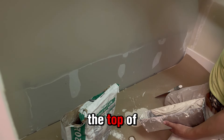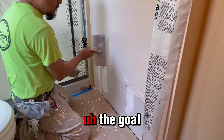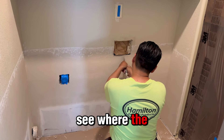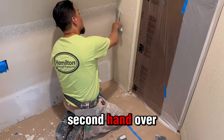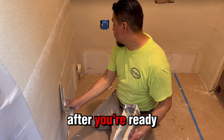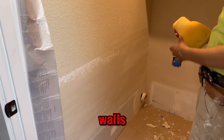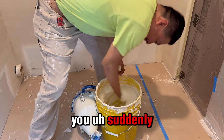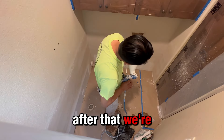We're covering the damaged parts and also doing a little bit more at the top so it can blend in and you don't realize what we did. The goal is just to create the texture so you don't see where the damage was made and the walls look exactly the same. As you can see, we're giving the second coating so it will look perfect. After that, we're just gonna make a sponge wet and start scrubbing the walls to get rid of imperfections and lines.